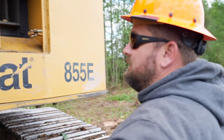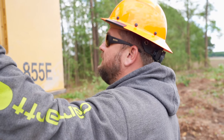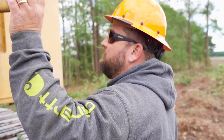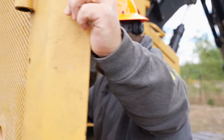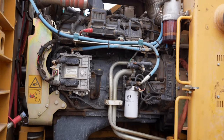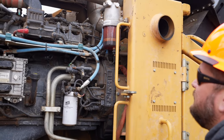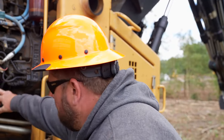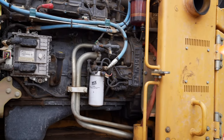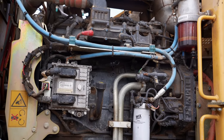You try to blow it out about once a week — depends if the trees are losing their leaves or whatever, and how much debris you get. Back here you have your engine. It's a FPT 6.7 Fiat — a very well-built engine. We've had no trouble out of these engines. Your two fuel filters are here; your engine oil filter is on the other side. These engines are very well put together.